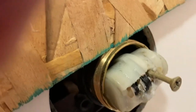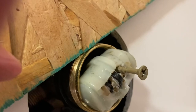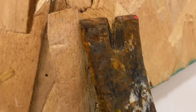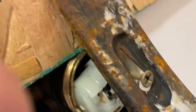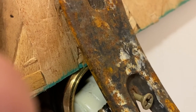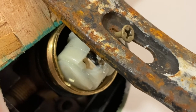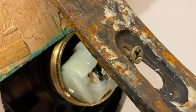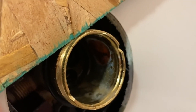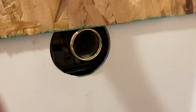It did finally work. This thing was wedged in there, and I put my little pry bar on here with a piece of wood above so that I wasn't prying on my brass or on my tub surround, and I just pulled carefully. It's pretty scary — this whole assembly wanted to pull out, and God forbid I would break a pipe back there. But I was just real slow about it, and it just popped out. So if you get into the same problem that I did, maybe that'll help you get it out of there.